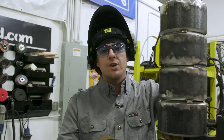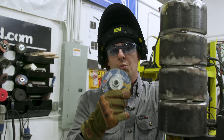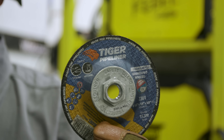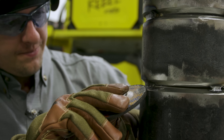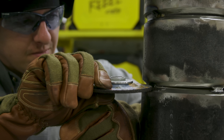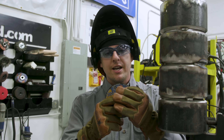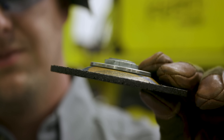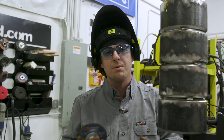There are a couple of methods to tackle this problem with different wheels. I've been using the Weiler Pipeliner — I like it because it's thin. You could grind at zero to 45 degrees, or you can notch with it, coming in there and just notching. That's my favorite part with this wheel. Also, if you're really wide, you could eat your bevel away right here, which makes it harder to fix your problem.